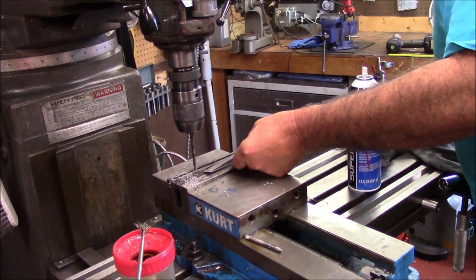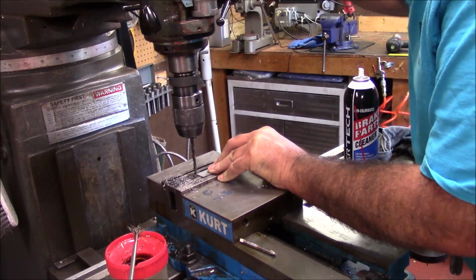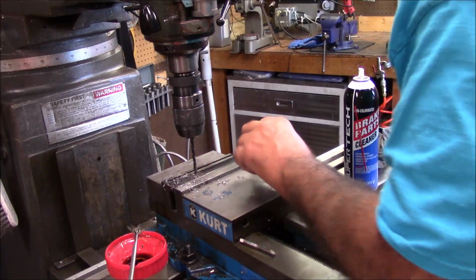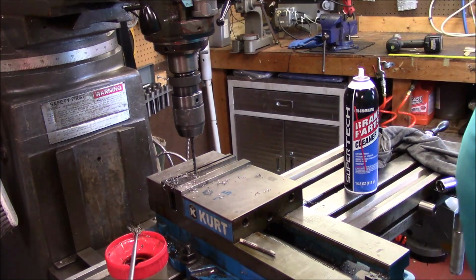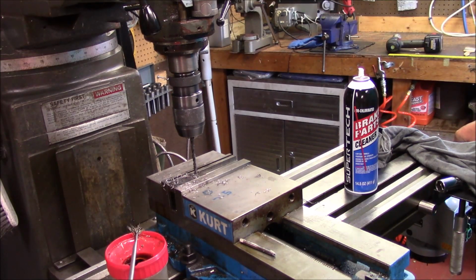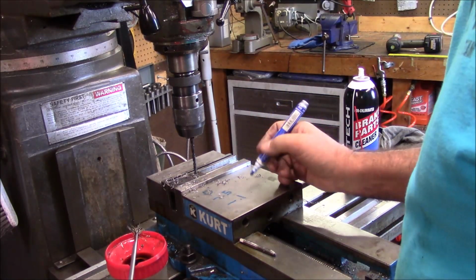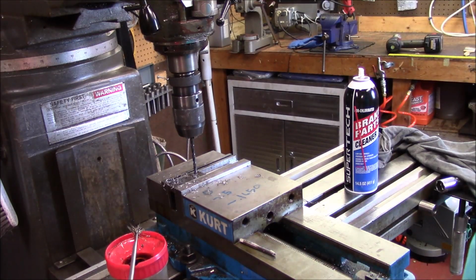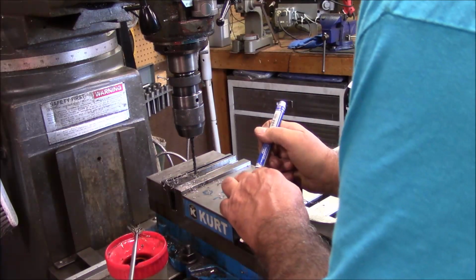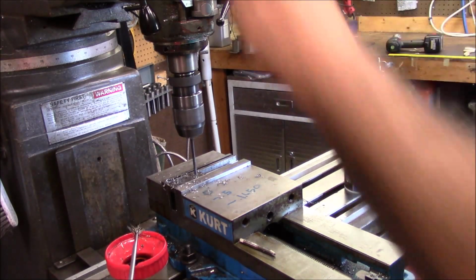And what I'm doing, instead of trying to do a bunch of math, is I'm kind of designing this as I go along off of how this looks. So now see, this will here be the flat. So with that being 1/2 inch, that's 1/662. So what I can do is I want to round it up to a round number. So I'd rather it be a little shorter. So I'm seeing 62. So I'm just going to go 1/650. A few thousand shorter. Because there's no design to this. So 1/650. That's a little bit over 1/2 inch long there slot. So, well, that's actually a little over. Oh, excuse me, got the period in the wrong spot. 1 inch 650. That's actually a little over 1 inch slot. So that'd be cool.